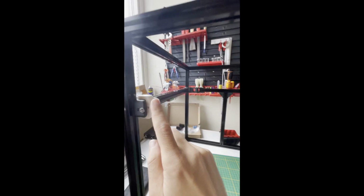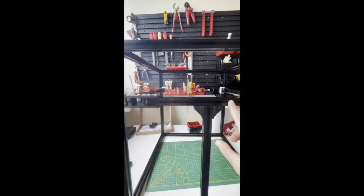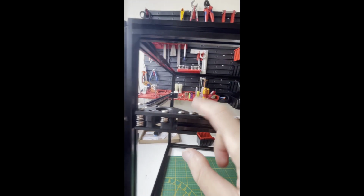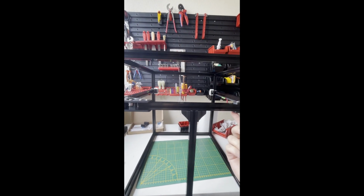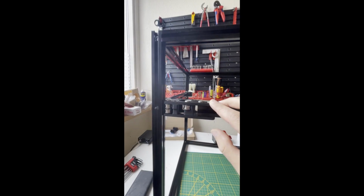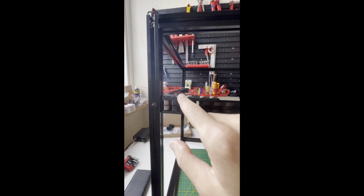After putting this one and the idlers, we are placing the back frame. This is the frame which does not have any tap or hole, and is the shortest one. And basically you need to put four T-nuts on the top and 6 T-nuts on the bottom. After that, just again place your, actually one correction, do not tighten this one yet.